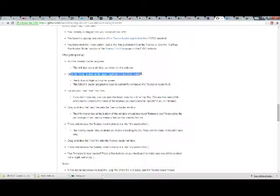Click the auto button on the upper right hand side of the window. The button will light up brighter green. This tells the loader program to load its current file whenever the Teensy is ready for it. Locate your .eep and .hex files, your EEP and hex files. If you don't have any, you can grab the latest ones here at a Dropbox link in a .zip file. Choose the newest file whose name contains the name of the key map you want. Look for QWERTY if you're not sure.